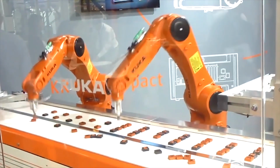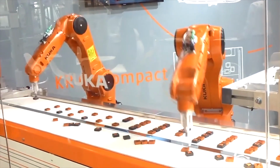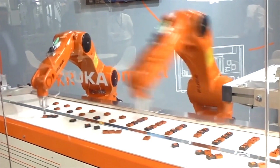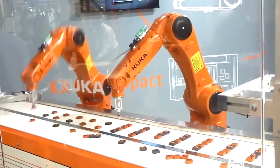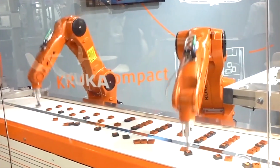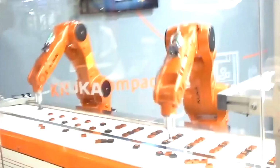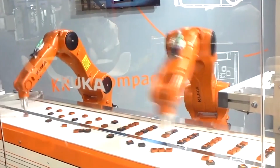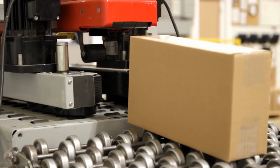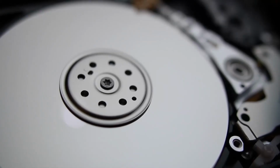Computer-controlled stepper motors are a type of motion control positioning system. They are typically digitally controlled as part of an open-loop system for use in holding or positioning applications. In the field of lasers and optics, they are frequently used in precision positioning equipment such as linear actuators, linear stages, rotational stages, goniometers, and mirror mounts. Other uses are in packaging machinery and positioning of valve pilot stages for fluid control systems.